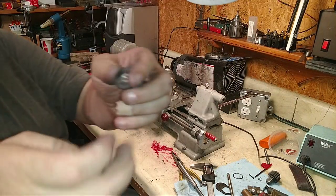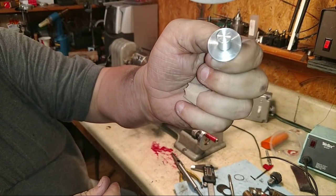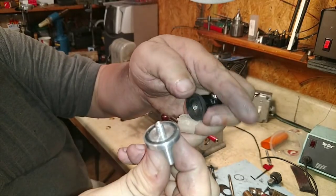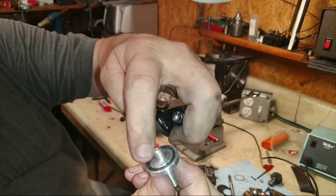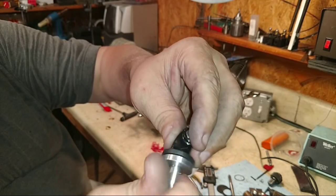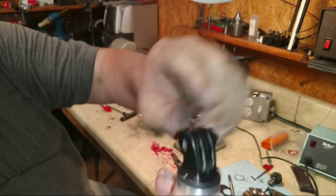That's what I need. And then she made this. That took her the longest, because that's about one piece of aluminum. And I cut the O-ring groove in there for her. I ground a bit, and we glued an O-ring in there. That's just to give it some spring so that when you tighten it up, it doesn't fall apart. And that's for our GoPro mounts on that.